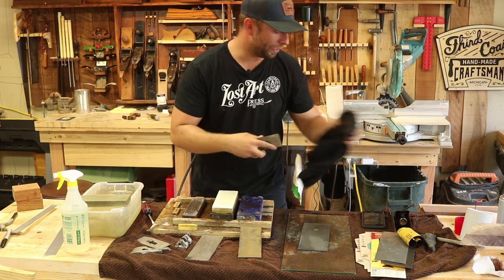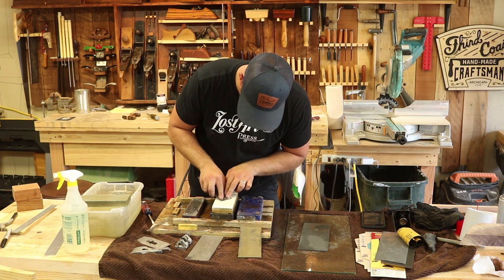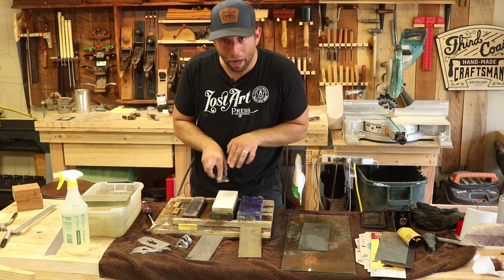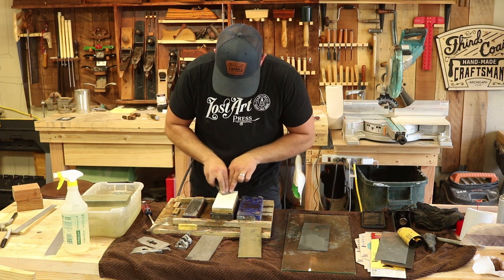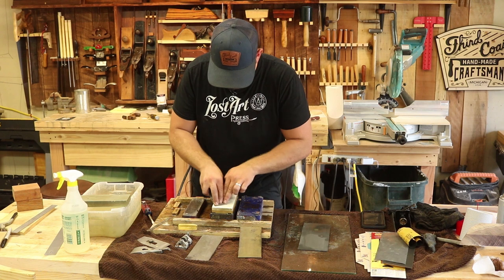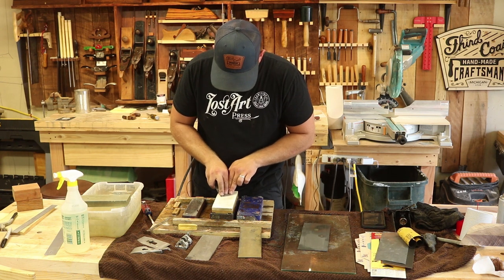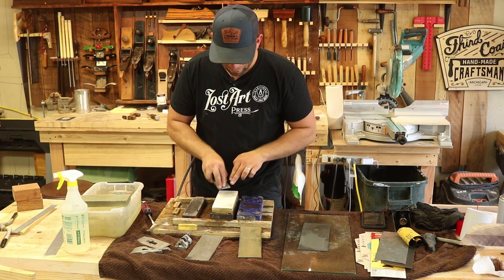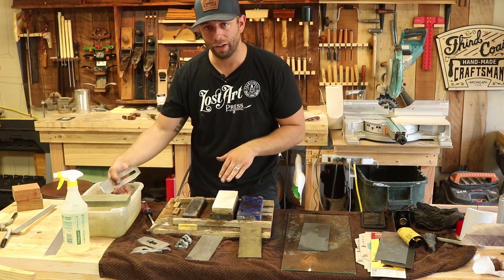Pretend I've used this blade a little bit — I don't need the jig; I already have my 25 degree angle established. I come over to my stone, feel where the bevel is flat, lock my body into place leaning over the work, and then I just do circular motions. I like circular motions — you can also do figure eights but they're a little harder to control. The circular motion is a really nice controlled pattern, and it's better than just going back and forth because here you're cutting straight grooves in the metal. With circular motions the grooves cut back and forth across each other — I feel like it cuts a little bit faster.